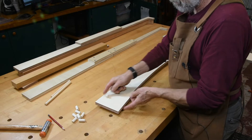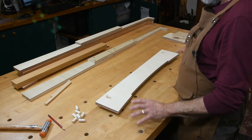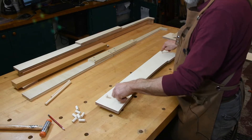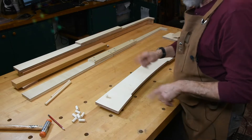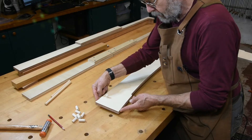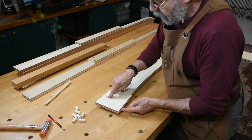In the videos I have a line drawn across here, and for that front narrower lower rail we shove it up to that line and register it against the line. Here we have these dowels to run it up against. So this template — the full width — is for that cloud lifted rail at the bottom of the back panel, and for the front of the case at that bottom rail, it registers up against those dowels.